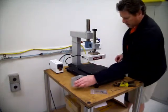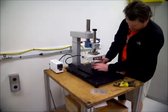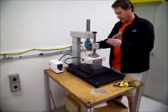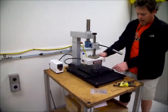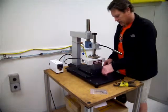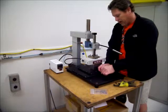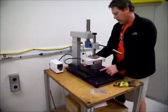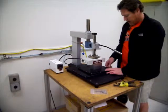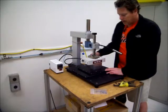I remove this — actually, it's premature. Throw the head back down. Before I remove that, I want to snug these set screws so that the X and Y plates can't move. Just drive the set screws in on the Y plates until they touch the dowel pin — do not tighten. Same thing on the X plates.